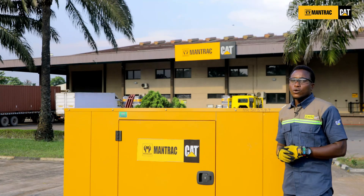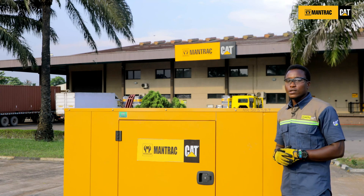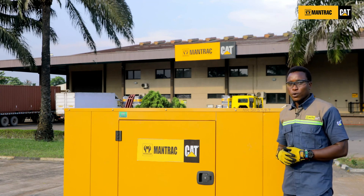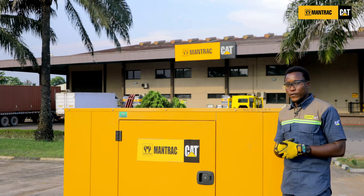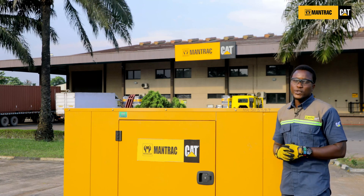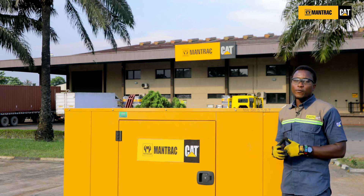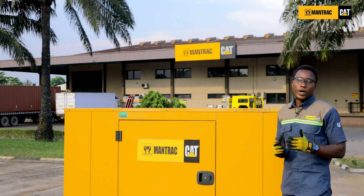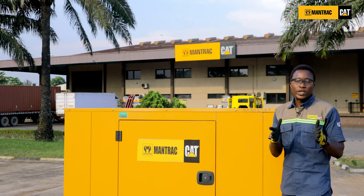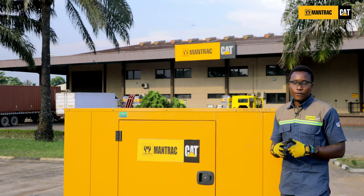On the third case, purchasing a 30 kVA gen set — which is an equivalent of 24 kilowatts with a power factor of 0.8 — brings the total load in this facility to 62.5%. Since 62.5% is more than the minimum ideal loading requirement and less than the maximum ideal loading requirement, this makes the 30 kVA gen set the best for this facility.